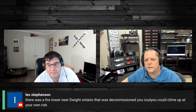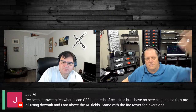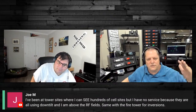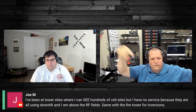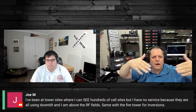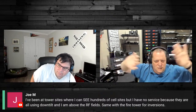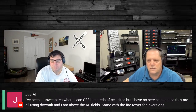Joe brings up a pretty good point. The next comment up, he's been at tower sites where he can see dozens or hundreds of cell sites, but you get no cell coverage. Because on cellular towers, they use down tilt on the antenna, so all the signal is concentrated towards the ground. It's like using a directional antenna, but they're pointed towards the ground so that coverage isn't being wasted, being spread out, and that allows them to reuse those frequencies at closer towers. So if you're above a cell tower, you may not have coverage because the antennas are pointing away from you.